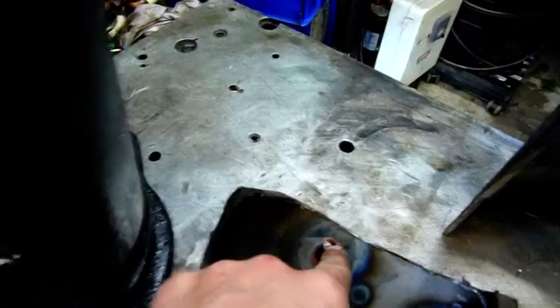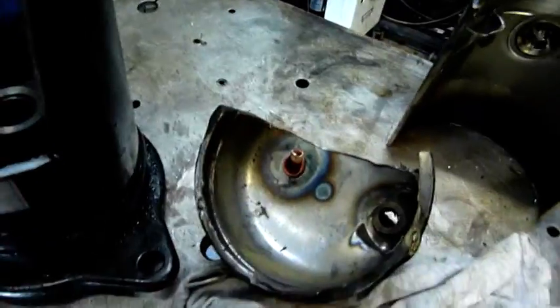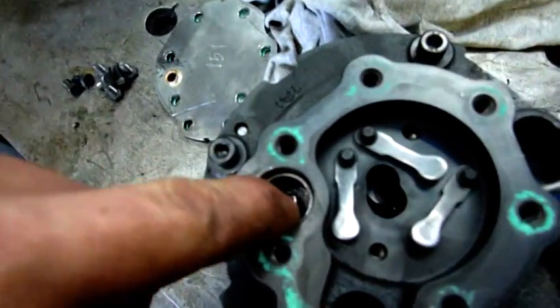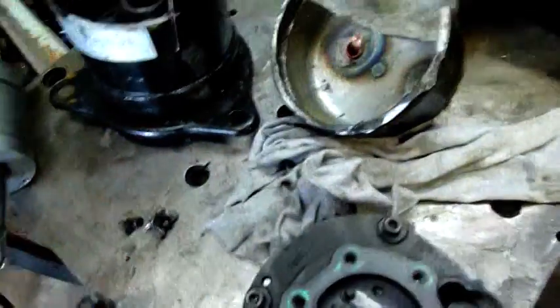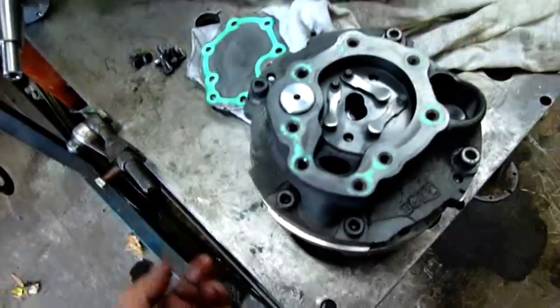There is a return line, which I've sheared off here, that was attached to the cylinder head plate. That goes to a solenoid valve attached to the discharge accumulator, so I'm guessing that's oil return. It's got a little piston with a piston ring on it and you can see the top of the moving scroll in there. So it's dumping oil back via a solenoid valve — this thing is really designed to return lubrication forcibly. And that's the head plate off it too. So the outside of the housing is the high pressure side.